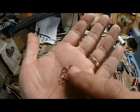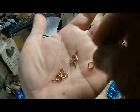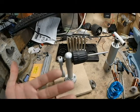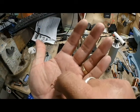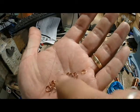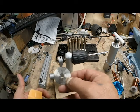Here are some rings right here. This is a good one - notice the slit is very narrow, whereas some of these others have a wider slit. I believe the wider ones were cut with the blade that came with it. If you also get too quick and try to rush it, it will crush your rings, mark them up real bad, and will break the blades. The blades are very fragile - this is my third one.